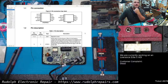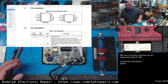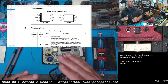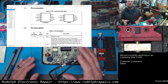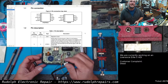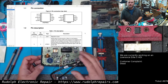We were checking VCC — ground the black probe, positive probe to VCC. With power plugged in: zero. Literally zero. No floating voltages, nothing, just zero. That's kind of weird. Press the power button — zero. That's on VCC to that chip. That's not right. Obviously the output's going to be zero too — we checked it anyway, zero.